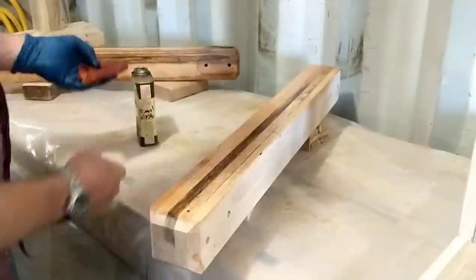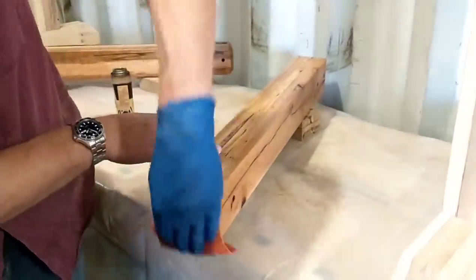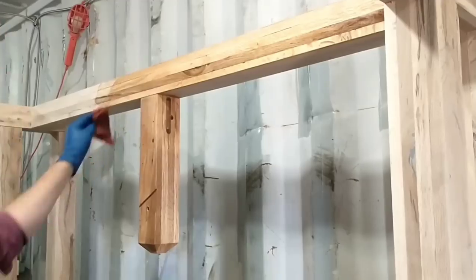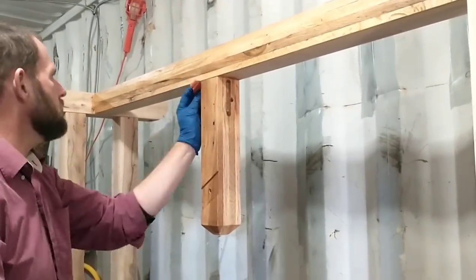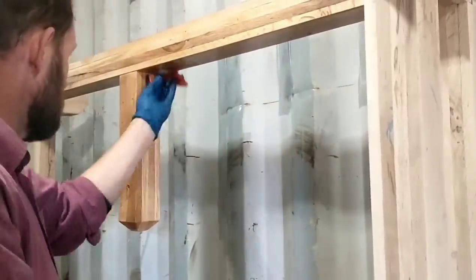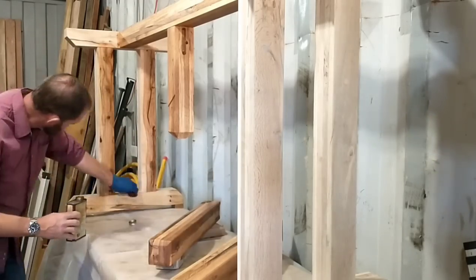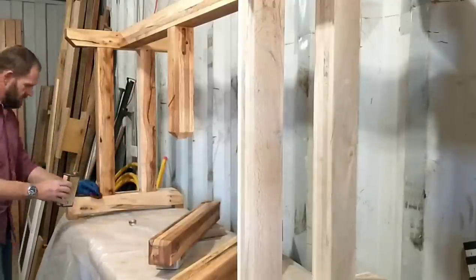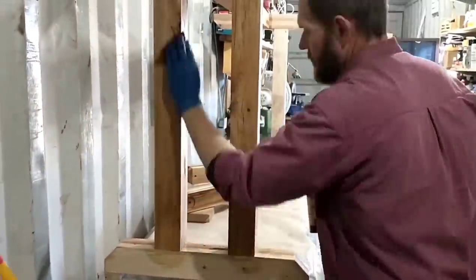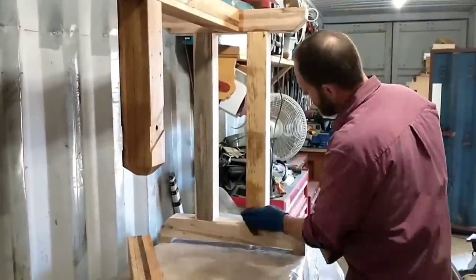It's finally time to apply the finish. I'm applying a nice wet coat of boiled linseed oil and enjoying the color and figure that it brings out in this wood. For the base, I'm just using boiled linseed oil — I'll be doing several applications, at least four and perhaps more, with a little bit of time for each one to dry. It'll leave a nice matte finish that's still beautiful and durable, but for the top of the table I'll be using a heavy-duty polyurethane finish. This oil is something we had left over from when we did the earthen floors in our home — bought it in bulk and had some left over. I have it cut with citrus solvent, which allows it to absorb deeper into the wood and dry faster. It also smells ridiculously good — just like fresh-squeezed orange juice.